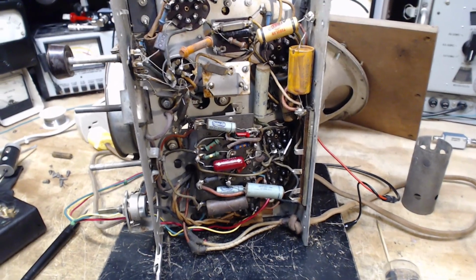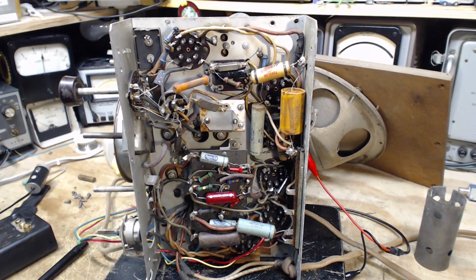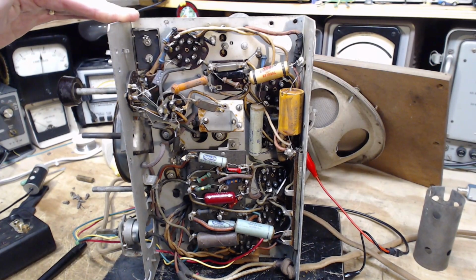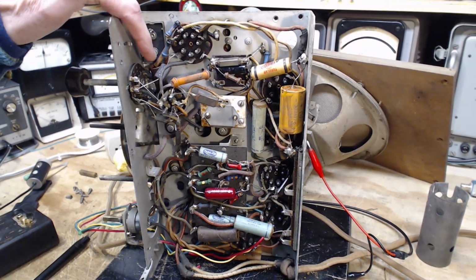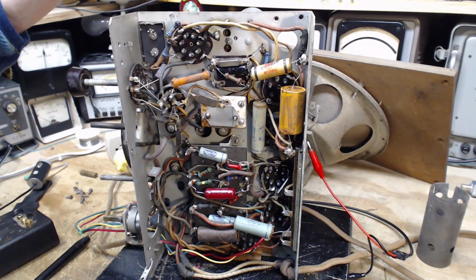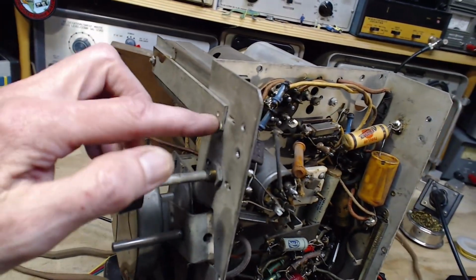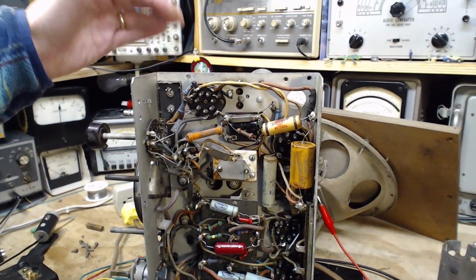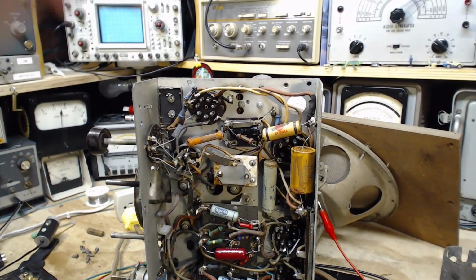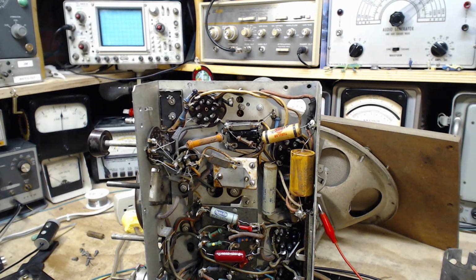So what have they done here with this radio then? Because it's pretty clear this is disconnected up here. Maybe if we study the wiring diagram. You know, another way is this capacitor. If this is one capacitor terminal, this is the other, and then the thing is grounded. And you can see they went through quite a length here to solder this on. And did they solder this part? No, this part is spot welded. This piece is spot welded on. So they really wanted to make sure this can was secured. That suggests to me the can is actually one of the electrodes here. So two positive electrodes, forming part of a pi filter, and in the middle is the field coil.